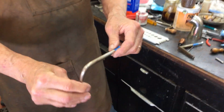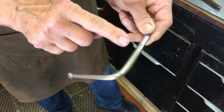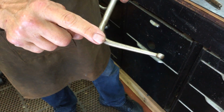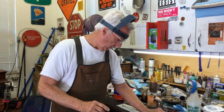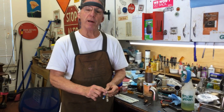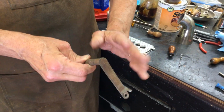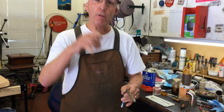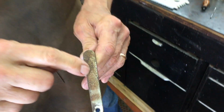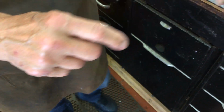Like on this Victor 4 crank, you can see here the way it looked originally. But this is all the body sweat, hand sweat, and it just deteriorates because they nickeled. This was bare steel and they nickeled straight on. On this terrible crank, I'm going to have my plater copper plate first. He'll strip all the old nickel off, polish, copper plate, then nickel plate. Why? Because that's going to fill up the pits that have pitted the metal. The rust.